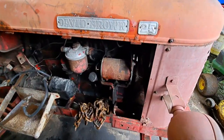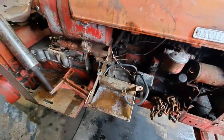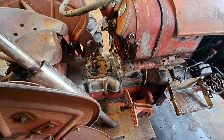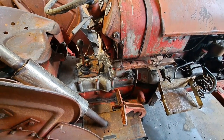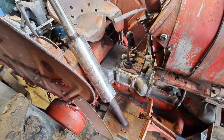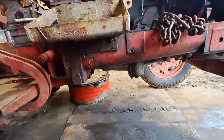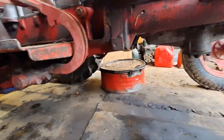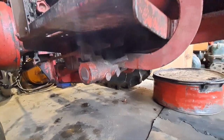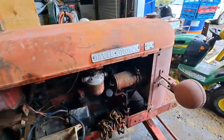The first thing that will go, generator will come off that. It will need to clean out. Starter, same deal. I might start with just the steering box and gear lever plate off. We'll need to clean the gearbox out, of course. Depends what it's like in there. We'll have to have a look. So it was pretty well covered in silt. So the engine sump off, and yeah, we're gonna take that drawbar off, and then we can get to the bottom of the gearbox and open all that up, drop all the fluids out. Want it off, makes it easier to work on.